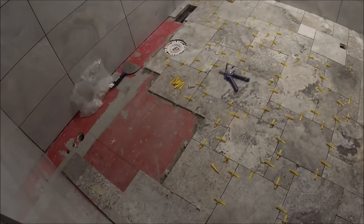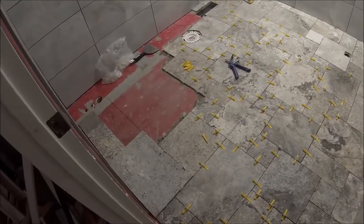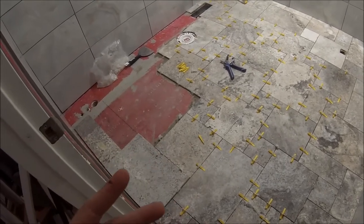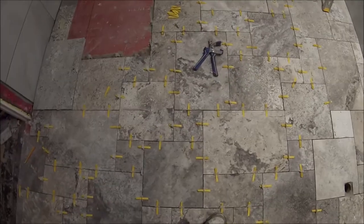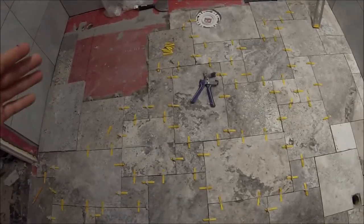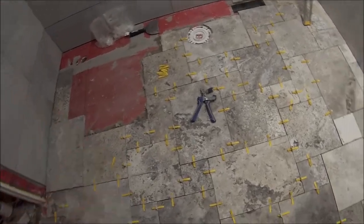It's not a big deal, but you just have to work faster. I got everything over here so I can just grab and place tiles before the thinset dries. This rapid set thinset dries in two hours — you can walk on it in two hours. You've got to go really fast because if you don't, stuff dries so quickly and if you've got a tile you need to align better, good luck.